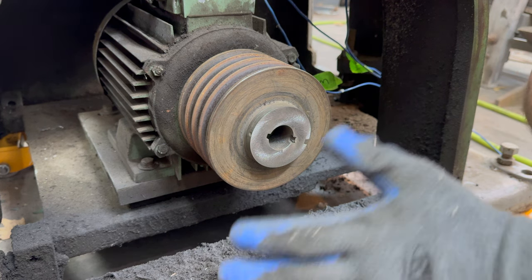The oil plugs for the lathe don't quite fit the 7/16 square drive, so I have an idea. .415, .414. Just knocked off the corners just a touch, and now it works perfectly.